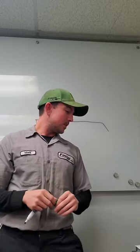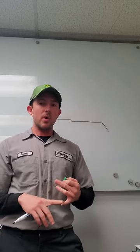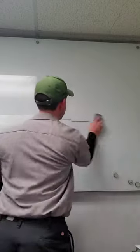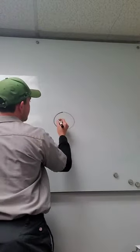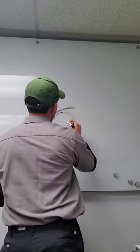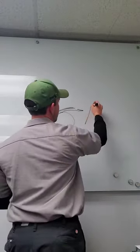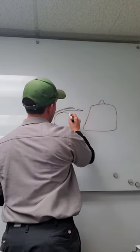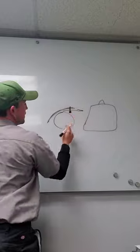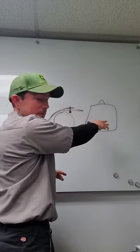Clipping dispersal — too much clipping: we're looking at cutting too tall on wet grass. On the QA5 units, there's a cutting unit hood that's going to determine some of the ejection into the collector basket. We can adjust this up or down — there's a little bolt adjuster right on the hood — and that's going to allow you to open or close it to allow more or less airflow to throw those clippings up into the collector.